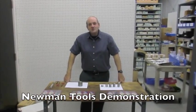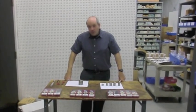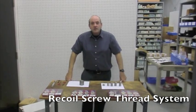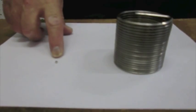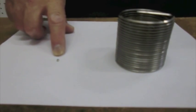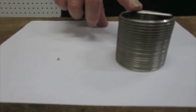Hi, I'm Tom Neumann from Neumann Tools, and today I'm showing you our recoil screw thread system. Recoils are the quick and easy way to repair damaged threads or to make strong original threads. We're stocking from 2-56 in the inch system, or 2 millimeters in the metric system, up to 2 inch 8 or 48 millimeter inserts.